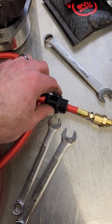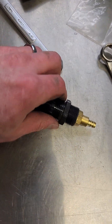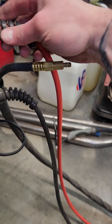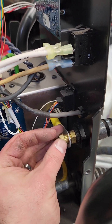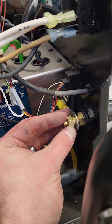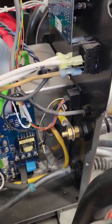Now I'm going to slide this strain relief through. You'll see that it bottoms out once you push it all the way through, and then you just go ahead and thread that strain relief on right onto the cable the way that it was. I just put the original strain relief back in, screwed that down, passed it through, and put the plastic lock nut on the backside. The main power cord for the TIG torch now slides right back over. We add the last brass nut to this equation, and it almost looks identical to the original installation. Tighten these two down, re-hook your gas line back up, and you're done.